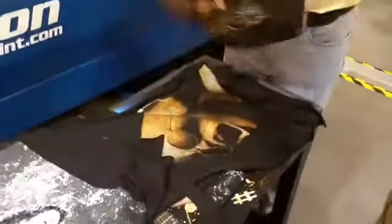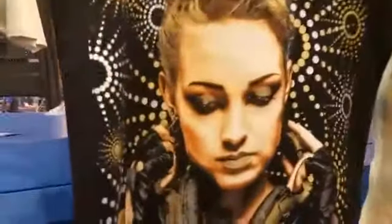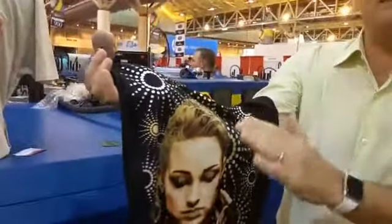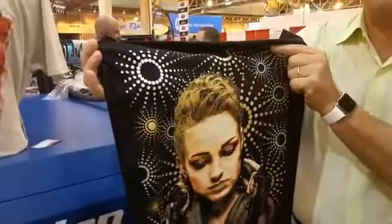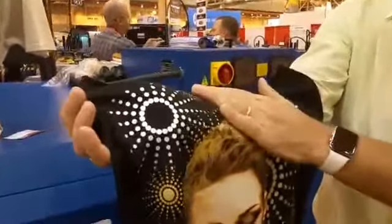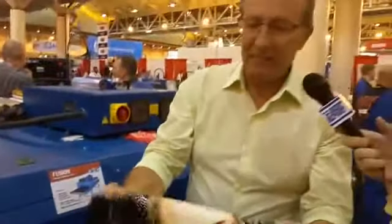This is another 4-color process. As you can see, usually you would approach this separation in a simulation process, but doing this separation in simulation process, you would need about 10 screens, or perhaps some more. This is only CMYK and two whites and CMYK and the specialty, of course, because when we go to print, we have to introduce our own specialty. Where does the gold come from? The gold is the metallic gold, metallic silver.